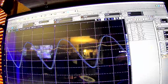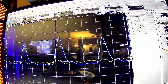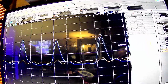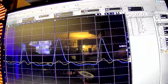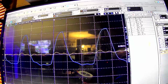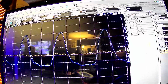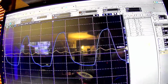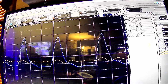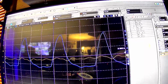Let's go back to square wave. See, the square wave is actually going negative now at 15%, because it's still an AC square wave we're generating here. And it will read both directions too. This demonstrates that it's bidirectional. Right now I got it at 30%, and that's above 0. That's below 0. I got it at 20% symmetry. 25% is closer to 0.